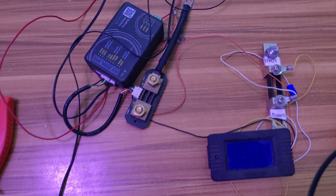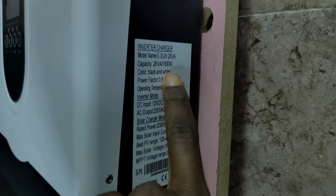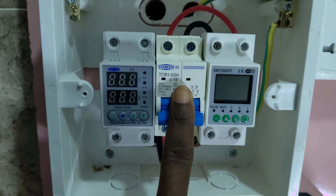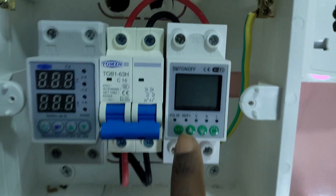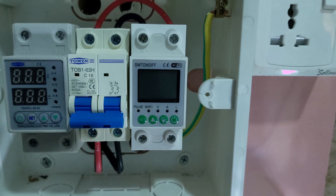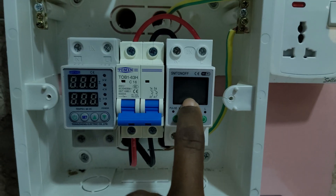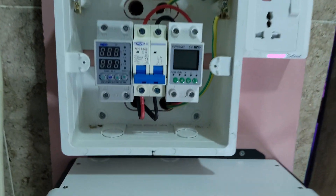To carry out the tests I'll be using this testing rig — it's a 2kVA, 1600-watt unit. The power factor is 0.8, which is why the watt rating is 1600W. This is the breaker I'll be using to turn off the load. It's a smart breaker with built-in Wi-Fi and can serve as over-voltage and over-current protection, unlike this other unit which does not have Wi-Fi. You can connect it to the internet and switch the breaker off from anywhere.